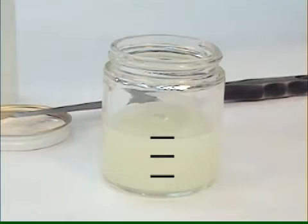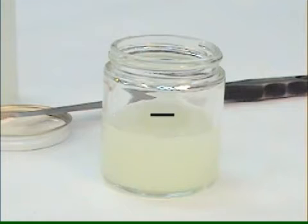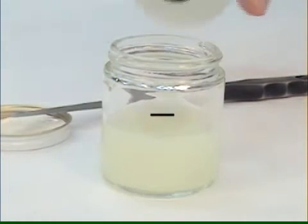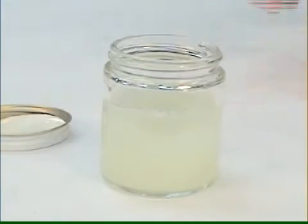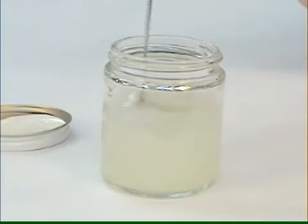I want a relatively thin varnish mixture, so we add the polymer varnish gloss and then add about 25% water to create a 3 to 1 mixture. Begin stirring the varnish and water together. Stir long enough to achieve a uniform mixture and then check the consistency.